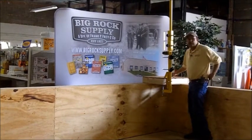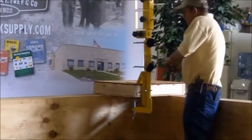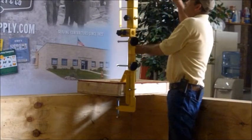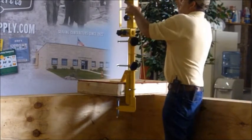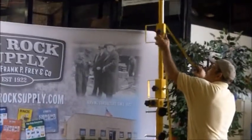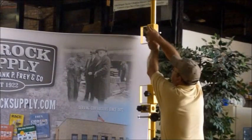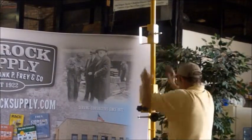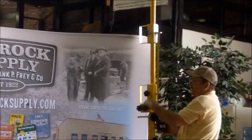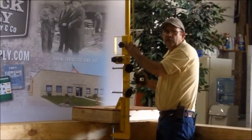Simulating that this is the deck we'll be working on: your OSHA requirements are 42 inches plus or minus three for your top rail height. So if I were going to be using the steel rails, I would take my center pin up to a 42-inch height and lock it in place.